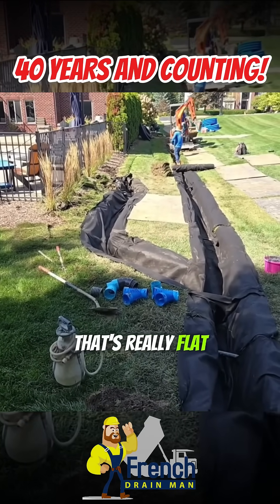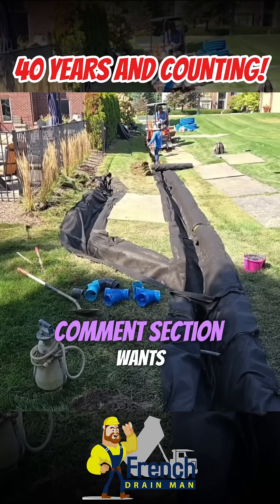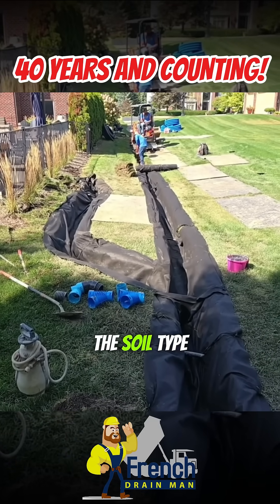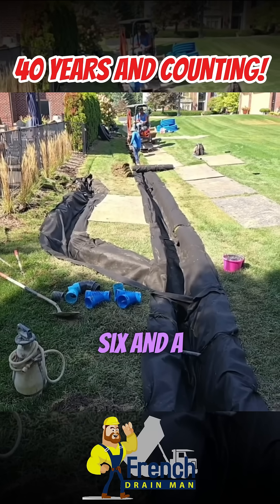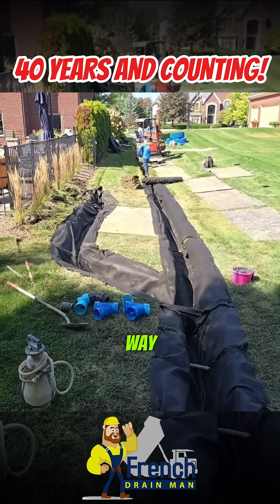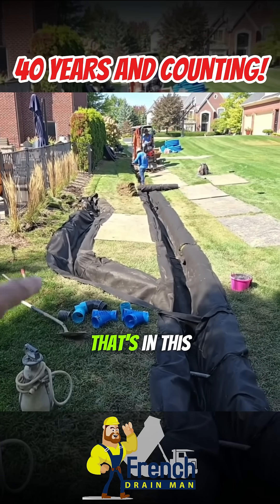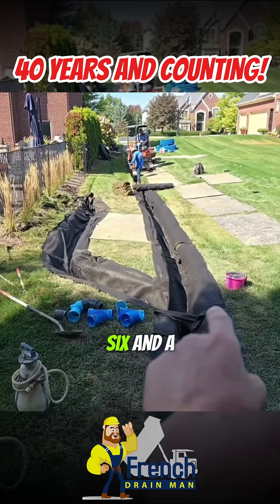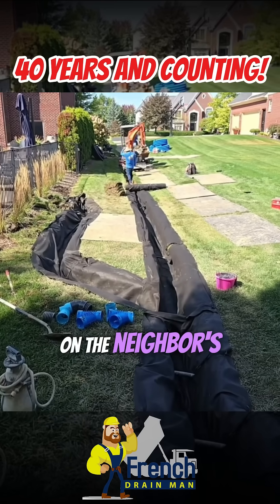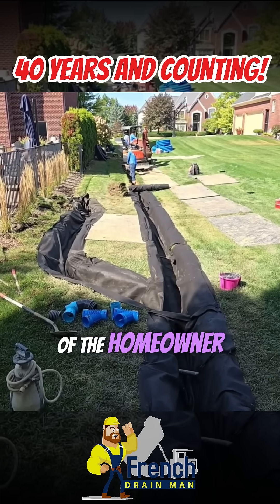Sometimes when you have an area that's really flat and really wet you have to run parallel French drains. Everybody in my comment section wants to know how far does a French drain draw water in from — it depends on the soil type. In clay, six and a half feet to be exact. So the men did parallel French drains here; it's the only way we're going to tighten up this troubled area. We're going to grab all the water in this bed area between the two French drains — six and a half feet to the other side. Plus we don't want to build on the neighbor's yard; we want our parallel drains on the property of the homeowner who contracted us.